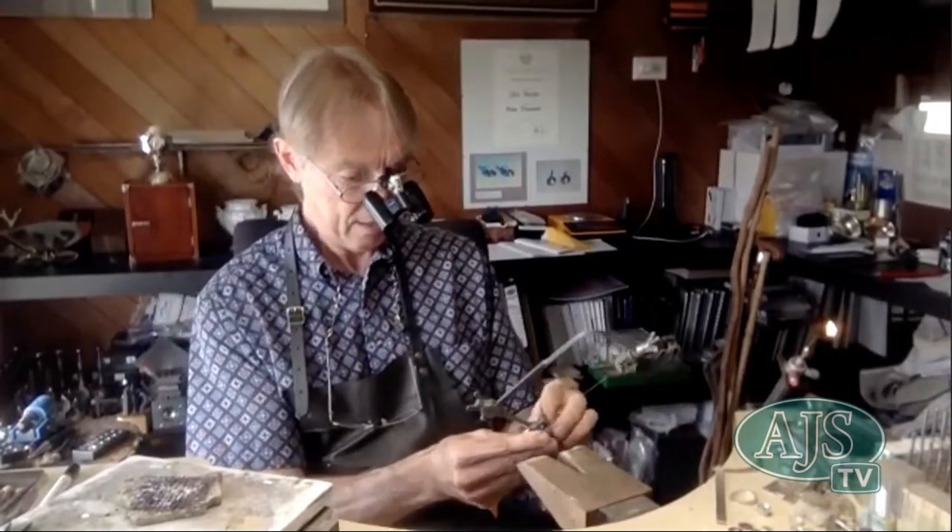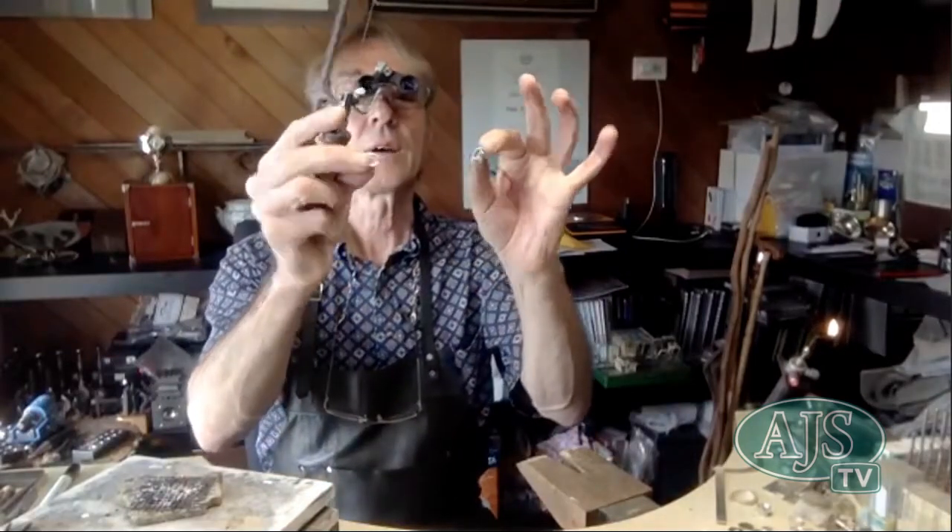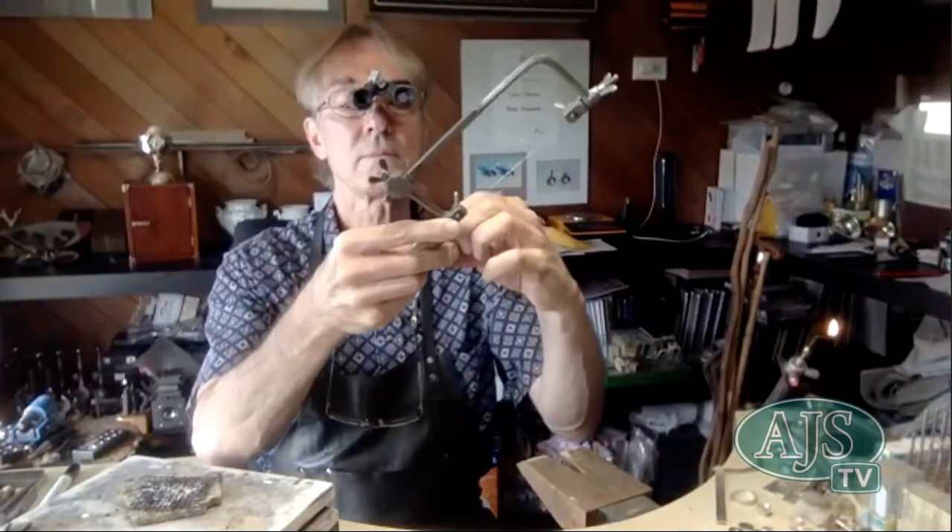If you're ever feeling uncomfortable sawing on the peg, just make sure you use your round and flat nose pliers — they're fantastic, probably the ones I use most often after parallel pliers. They get your fingers out of the way and save them for another day. Every jeweler remembers cutting their fingers a few times. I've done a few beauties and I don't want to do it today. I've now cut the collet into pieces.